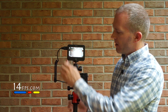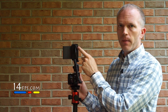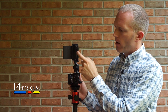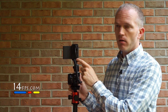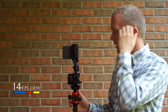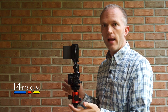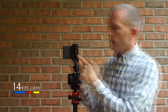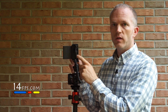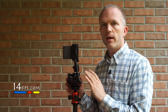It has an HDMI in, an HDMI out, and a 3.5mm audio jack in and out for monitoring, which is really nice. So if you have a camera like the a6000 where you don't have a line in or line out for your audio — all I have is a micro USB and an HDMI out — you can plug in your wireless audio system and bring audio directly into your video straight into your camera.